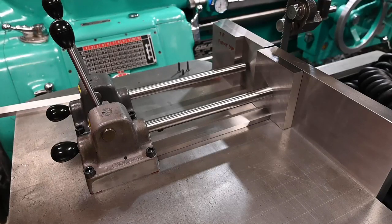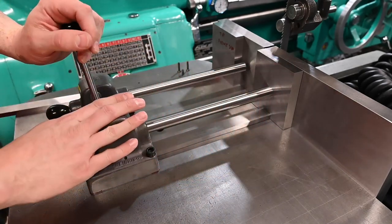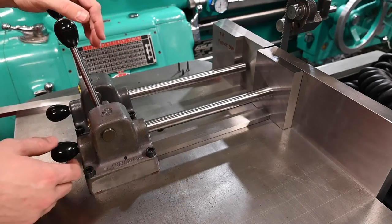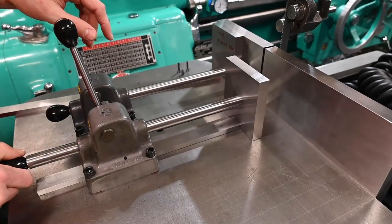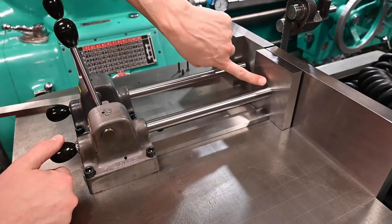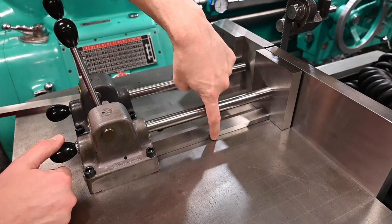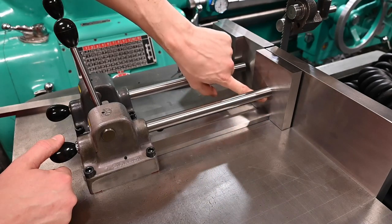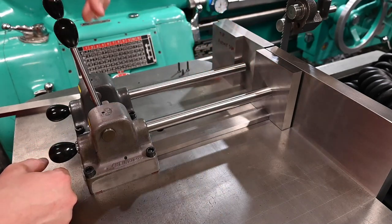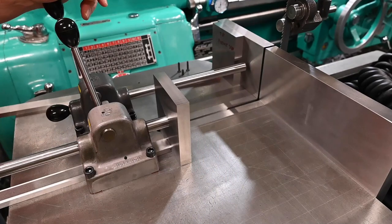So normally I just dive right in and we just start figuring things out together. But I did this one off camera to give myself full focus and make sure I didn't make any mistakes. I might still make mistakes today on the second one, but I did want to do this a little bit different than normal. So this got done. Basically had to make the hole for the rod, mill out that pocket on the bottom, drill holes for mounting the bar, and drill through here for a set screw, drilled and counterbored in the rod itself to accept the set screw, and got it all mounted up here. So that was a few hours work, but came out pretty nice.